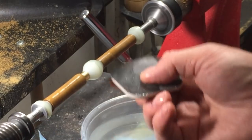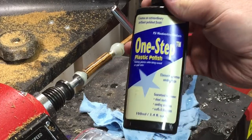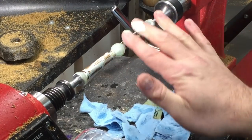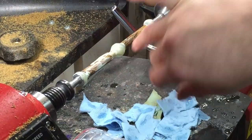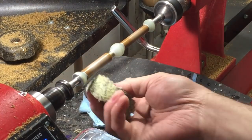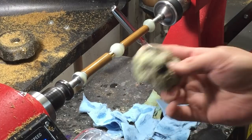After going through all the micro mesh grits, I'll dry off the pen blanks with a towel with the lathe off and then move on to polishing using a plastic polish. I like to apply the plastic polish with my fingers, rubbing it all over evenly, then let it sit for a couple of minutes before buffing it off. The grit of this plastic polish is slightly lower than the 12,000 micro mesh, but I still see a difference using it. With the lathe at 2,500 RPMs I take a small cotton buffing wheel and buff out the plastic polish — usually two coats.